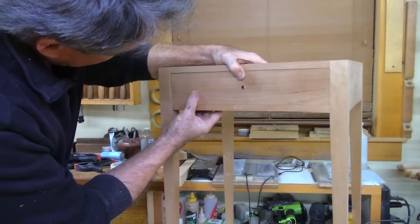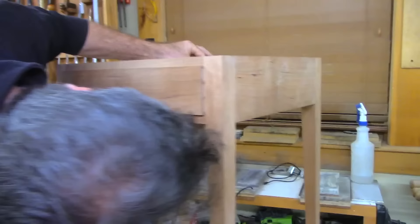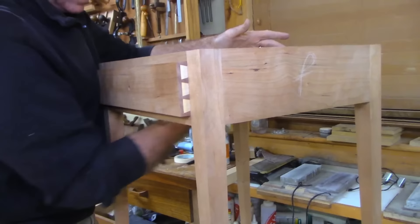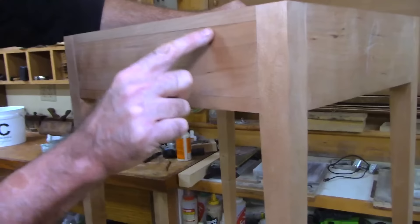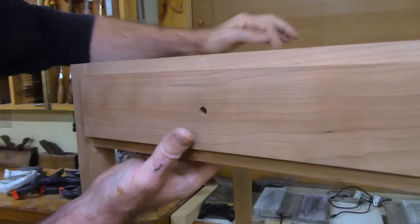It fits nice — just listen to the sound of it. It's still a little snug in the back. Sometimes if your runners rise too much you'll get that. I can see the top is open, and I can't wiggle it up and down — a little on the right but not really any on the left. Look how snug it is — it's right up to the top. I've got to get more off this to allow for expansion and contraction. It's a little snug right back here.